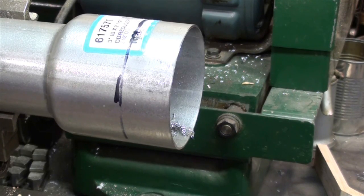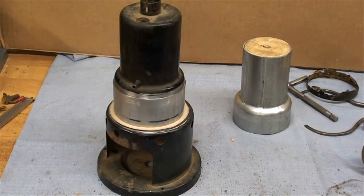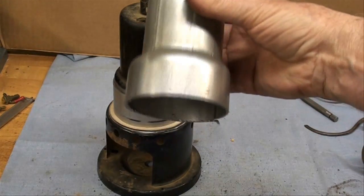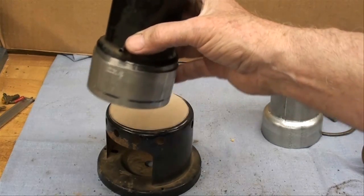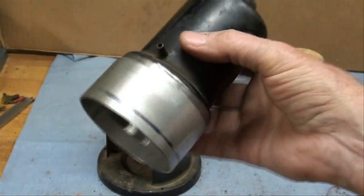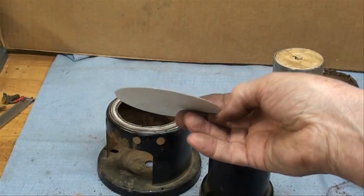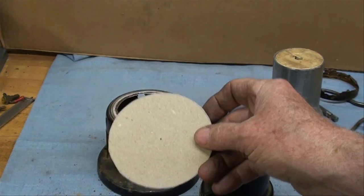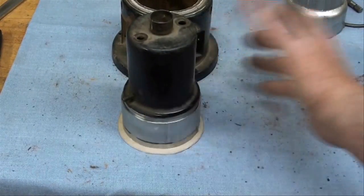Here's what I've got to this point, and I still have enough material left for Plan B if necessary. That looks like a boiler in itself, doesn't it? There's the extension on there, so I hope to silver solder that on rather than brazing it all the way around. For a bottom, I'm going to take a piece of 16 or 18 gauge plate, cut a circle — this is just cardboard as a template — and that will be silver soldered onto the bottom.